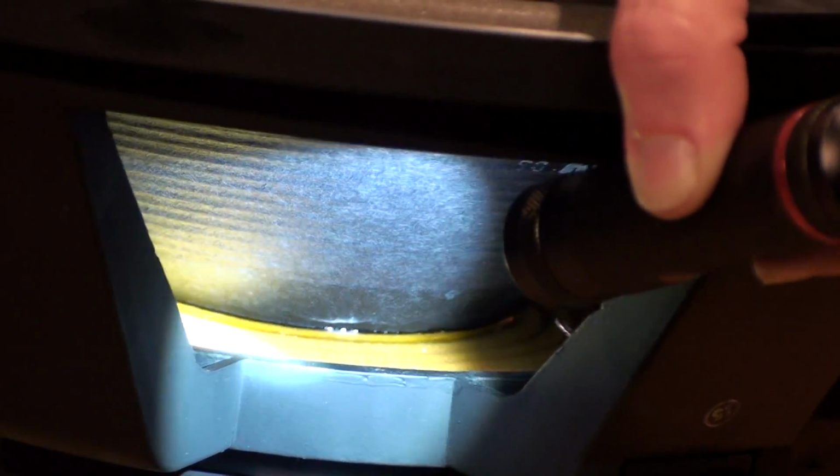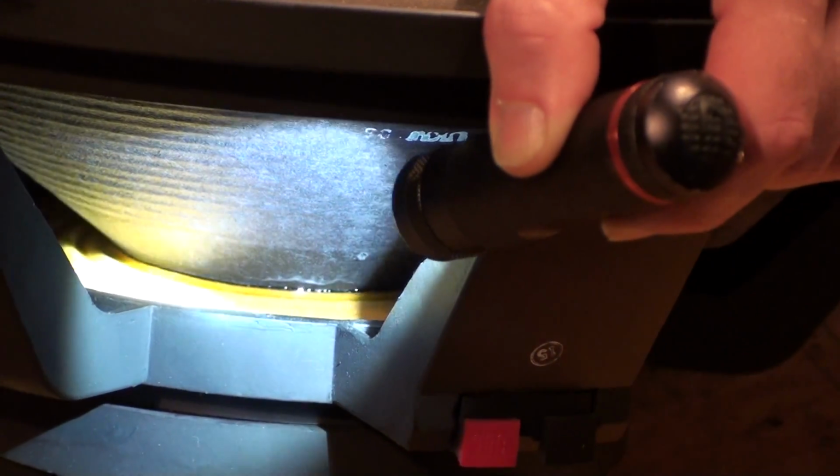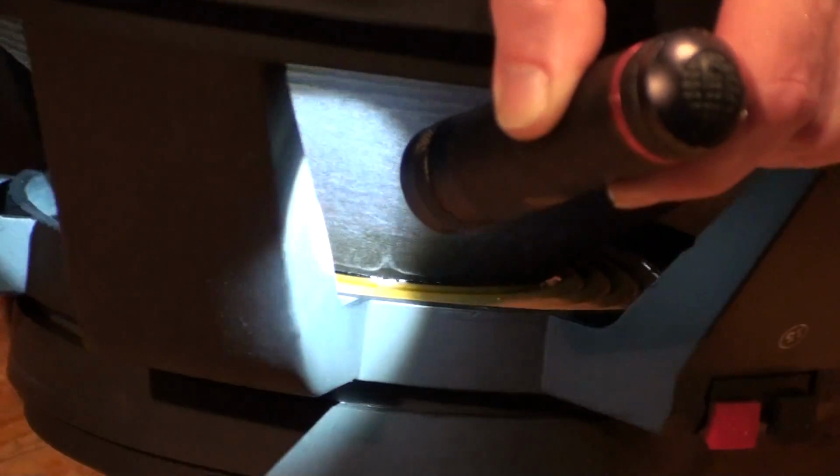If you look inside here, sorry about this, people. Right down inside here, you can see where the epoxy is laid down, and it's not spilling up on the cone too high, and it's also not traveling too far beyond the joint into the spider. So this is basically how you want it to look. You want it to be a very clean, very consistent, even bead all the way around. You don't want blotches and blobs everywhere. You want it to be very, very consistent.